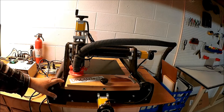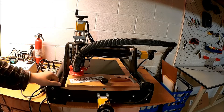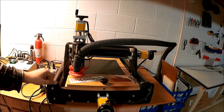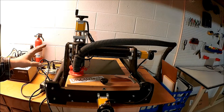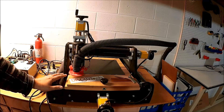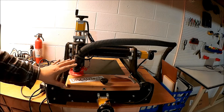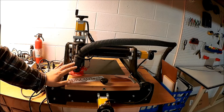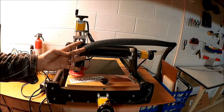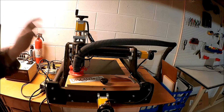The key to cutting any type of plastic is to move quickly so it doesn't melt. Use as few flutes as possible to reduce the melting, because you want to cut the material, not melt it — and that's always the problem with dealing with plastics. We're also going to go with a fast feed rate, something like 100 inches per minute, so it should whip through this pretty fast. I'm trying something a little different this round: this is only a 1/8-inch piece of polystyrene, and instead of two passes like I've tried in the past, I'm going to use four passes at a very fast feed rate and a relatively low spindle speed with a low number of flutes.